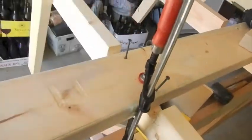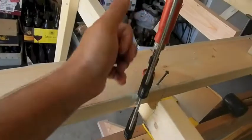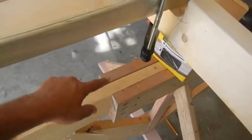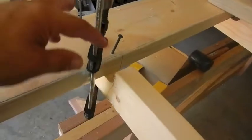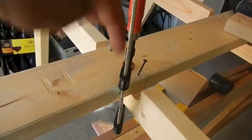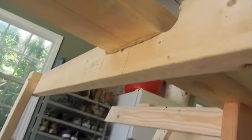In this case I've done that already — back them out, drop the clamp down, take the glue and put some on the frame down here, put it back up. It's already indexed because I've run the screws in it. Run the screws down and we're attached. You can see this one's been done — you can see the glue squishes out. That's how I do it, nice and simple. Since I do all this on my own, this is my helper.